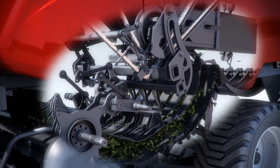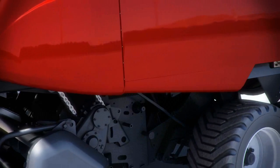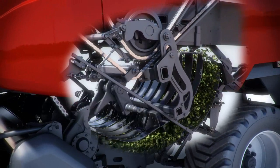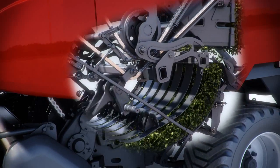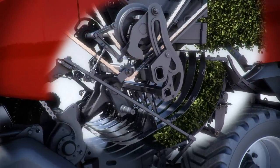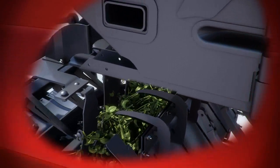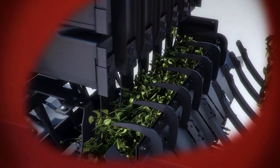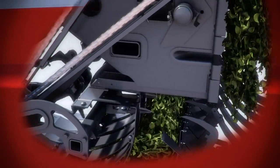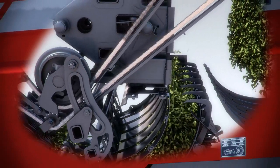When the proper flake density is reached, the pressure-sensitive door in the bottom of the chamber trips a cam mechanism on the stuffer clutch, starting the stuffer cycle. This engages the stuffer forks into the pre-compression chamber. Simultaneously, the holding fingers that prevent the flake from entering the bale chamber prematurely are withdrawn. The stuffer continues, and with a single stroke, moves the flake up and into the bale chamber while the plunger is moving rearward.